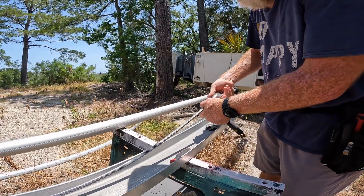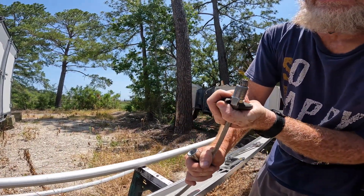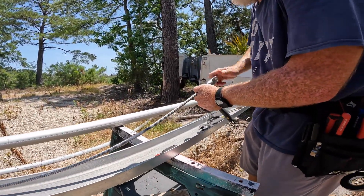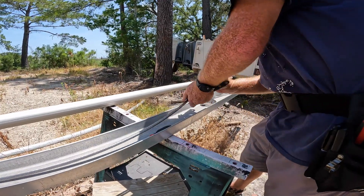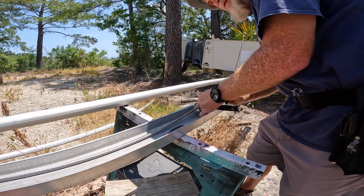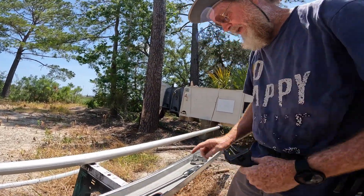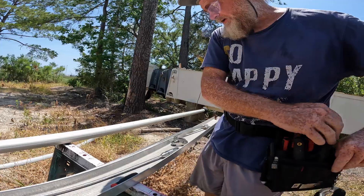The first couple I do I always go back and check, so once I get it there I unscrew it. Look at what the tips did — they're nice and even, there's nothing pinched, everything's good. There's enough space that it goes right to the end I left out so it all sits inside the cup. I inspected it, it looks good. If something's crooked, overlapped, or out of place I can see it. If I have screwed it up I have to cut that end off and start over, so when we cut cables we always leave them a little bit long just in case. I'll come back and torque that with a larger set of crescent wrenches to get it really tight, and that is how I do a stay lock.